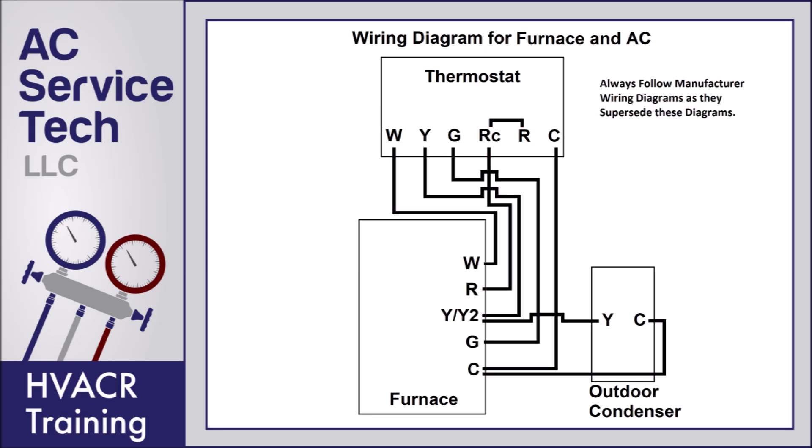This is generally what you're going to see when you find a wiring diagram in a thermostat manual or a furnace manual. They're just going to be black and white, so you just connect W to W, R to R. You can see that you have a jumper from R to RC, and that's because R is for your heat and RC is for your air conditioning. When you turn your thermostat to fan, it's RC that connects to G. If you turn your air conditioning on, it's RC that connects to Y and G. When you turn your thermostat on for heat, it's R that connects to W. That's why when you have a furnace and air conditioning system you have a jumper connected from R to RC, but you only need to have one wire coming out of one of the R terminals on the thermostat.